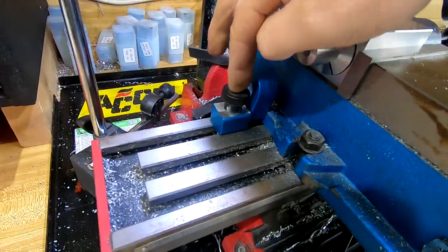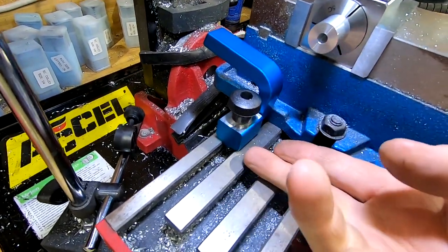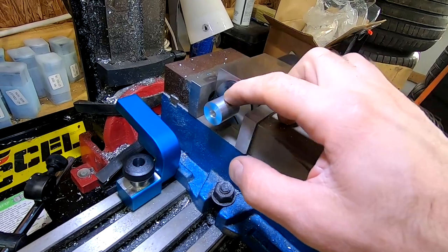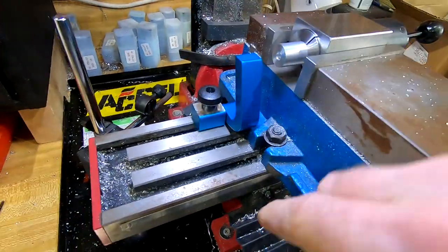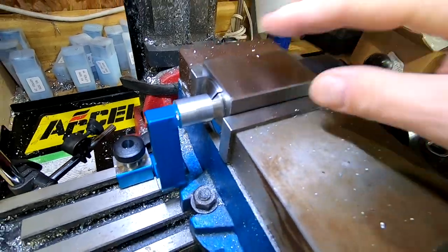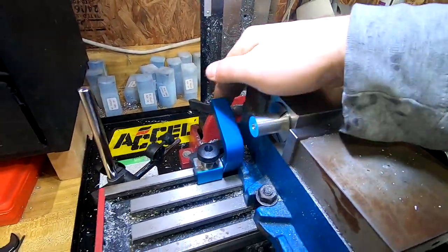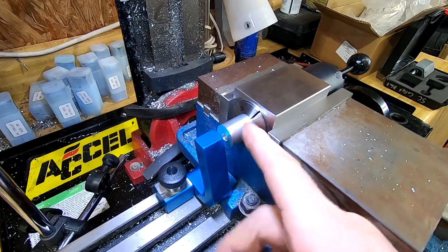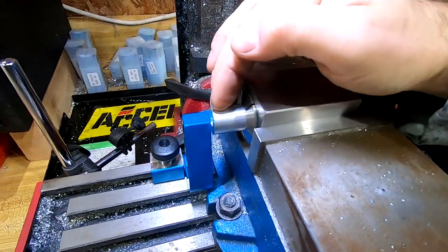Here's my setup. I did mill this flat. I'll load my clevises into the collet block giving myself about seven eighths of an inch stick-out, so I'll have about an eighth inch clearance to the collet. This folds up and just so happens it bottoms out on the vise right there, so it'll be in the same spot every time. I slide this until it touches, tighten it down, fold it out of the way, and mill my slot — then just repeat the process. That way I don't have to be so accurate — it takes out the variable of how deep the clevis is in the collet.